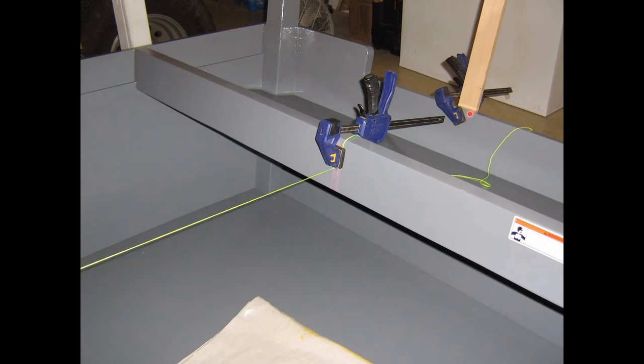underneath this transom cutout. So that's saying this splash well would ideally not swamp with water, which they usually do, and you need to subtract this volume of water from your displacement calculations. But in our case, since we're using a long shaft motor, and the way we've defined the static float plane, we're just underneath that transom notch, so it makes our calculations easier.